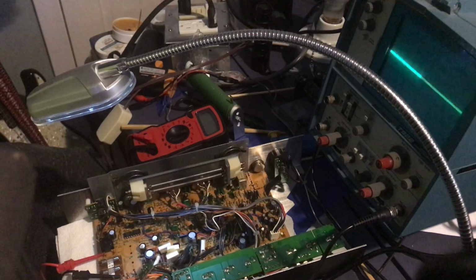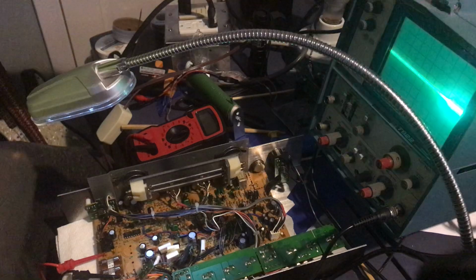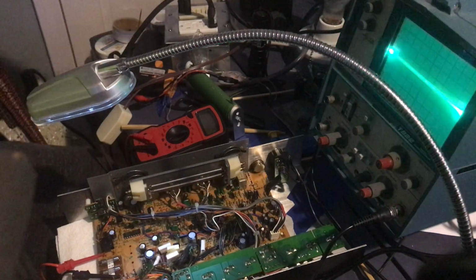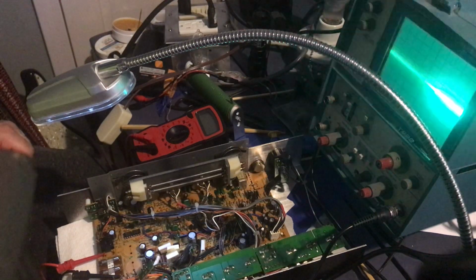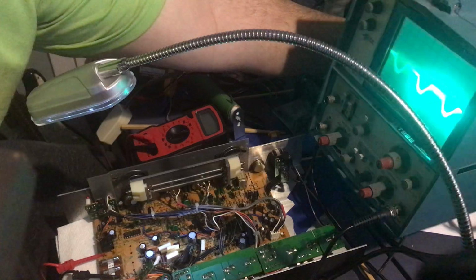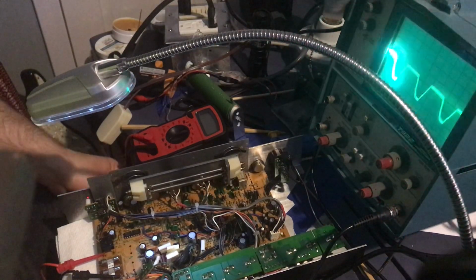I am going to turn on the circuit that forces electricity to go through this dim bulb current limiter in case of a short. So that's on. I am going to turn the variac on. It's at 0 volts. I'm going to turn on this chassis. And now I'm going to dial up the voltage. And you see a signal on the screen. Interesting.